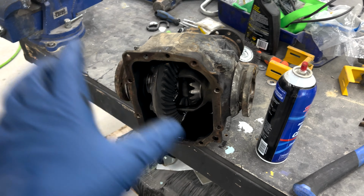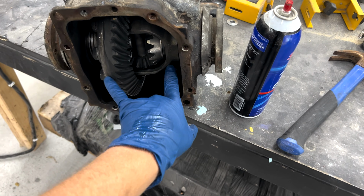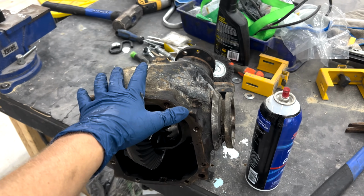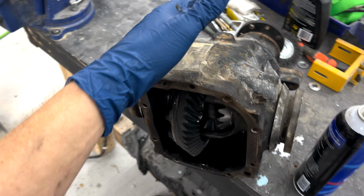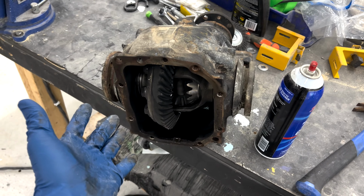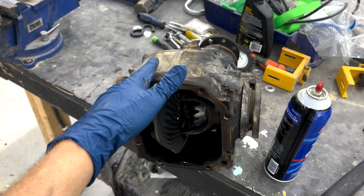Now, some solid rear axle cars like Mustangs, it's the same style setup, but you're gonna have to pull this carrier out to weld it, just because it's kind of hard to do it in the car. Whereas with like a BMW, 350Z, IS300, so on and so forth, you can pull the whole entire diff out. And that's what Dawson went ahead and did for me, which is pretty basic and self-explanatory. It's also different from car to car, so I'm not gonna show you all that. But basically, he pulled it out, he drained most of the fluid out, and gave me the diff to weld.